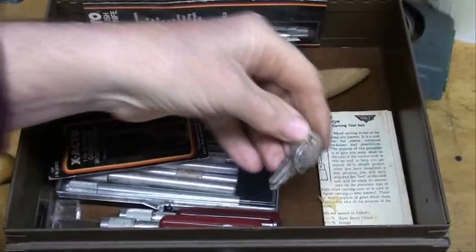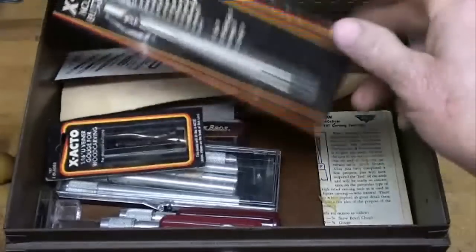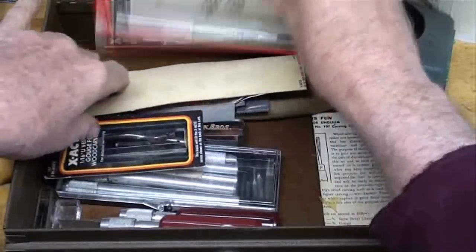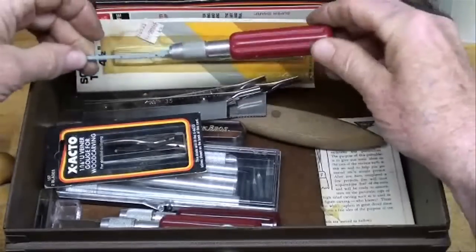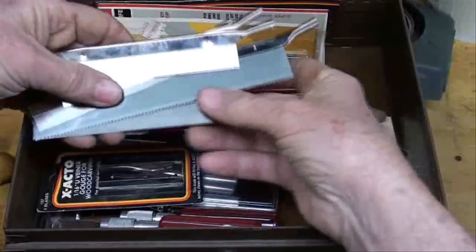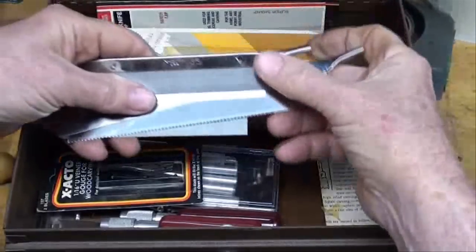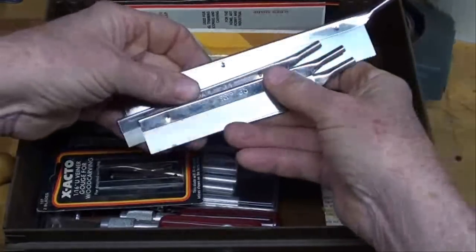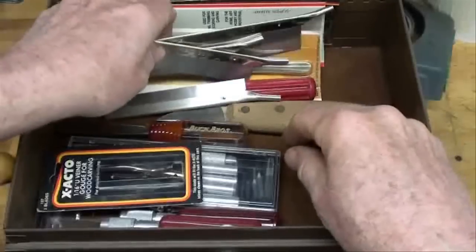Along with the original set of keys for the box. On the back here we've got some X-Acto knives — there's a push-button X-Acto knife still in the package, a couple others still in the package. There's a little saw blade and an X-Acto handle. These little fine-tooth saw blades are like little back saws and will fit into this type of handle. They're really wonderful when you're cutting balsa wood or basswood and making models or doing very small work because they don't leave a burr.